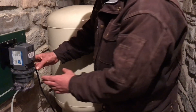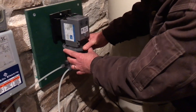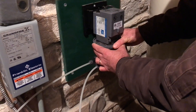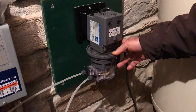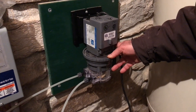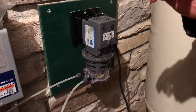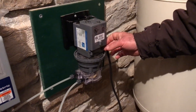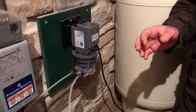This injector pump is adjustable. I can rotate this ring to vary the amount of hydrogen peroxide that's injected, and what I'm aiming for is about 25 parts per million. I have some paper like litmus paper that tells me what the concentration is, and at the current setting it's what I want and it works quite well.